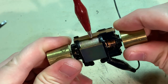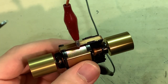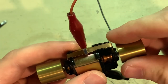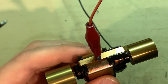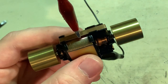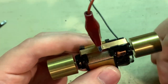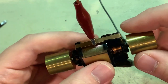I'll just twist one of them and give it a try — still vibrating, that's a little better. It looks like the counter-balancing can't be done quite perfectly with these, but sometimes you can get dead on just by giving the little flywheels a twist until they counterbalance each other. When they're balanced that reduces noise and wear, so it's definitely something you want.